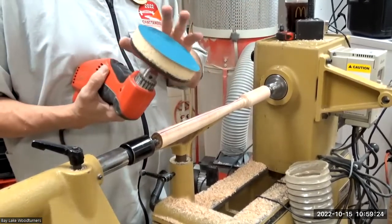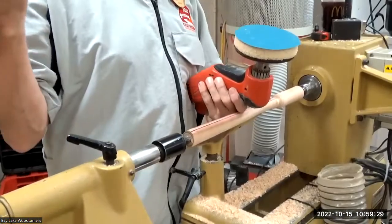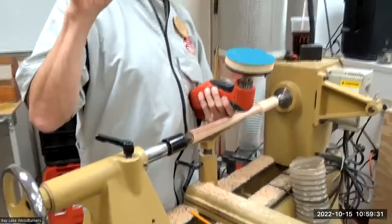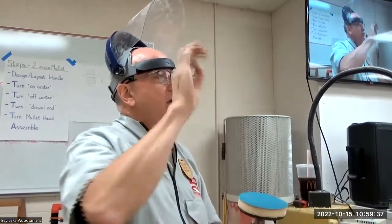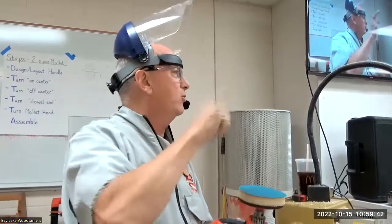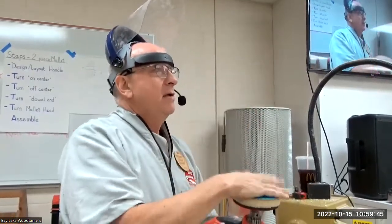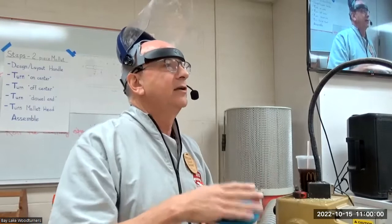The foam will last a long time if you spray fixative on it. It's basically a lacquer, like a flat lacquer, but they call it artist fixative. So if you were doing a charcoal drawing and you got the charcoal piece to look just the way you wanted, the artist would spray on top of that charcoal and then it doesn't smudge, right? But it's a good surface for the adhesive back sandpaper that'll stick to it. And I'll spray fixative on here once or twice a year. I'll probably knock out anywhere from 10 to 20 bowls between spraying it. And it holds really well.